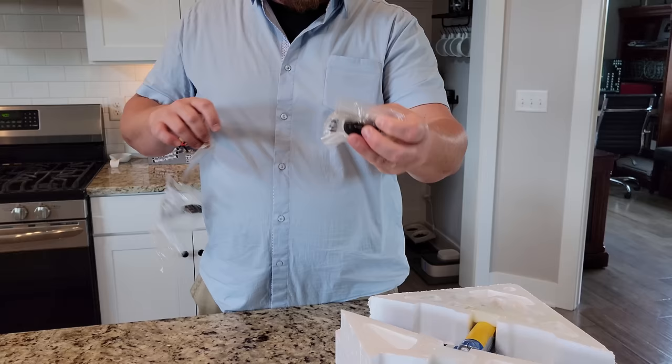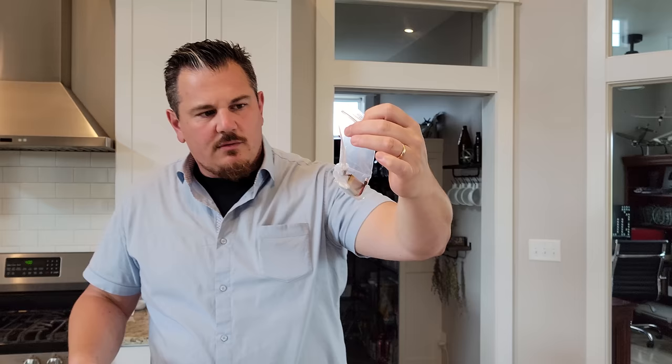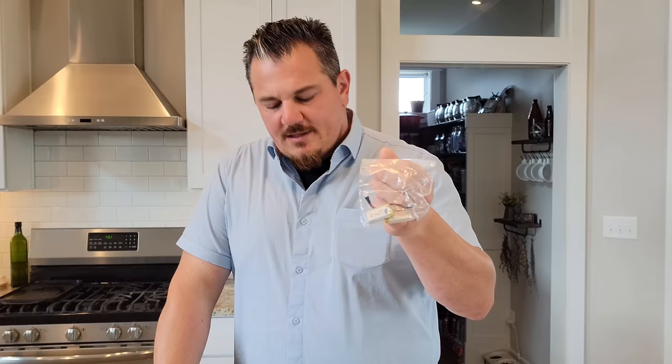And then we have a charger. Ooh, charger. We're gonna get into charging right away. And it looks like a couple of additional spare batteries that have not been secretly hidden in the fuse. What size do we have? These are 400 milliamps and they are 1S, so one cell in series. Yes, I know that seems a little bit intuitive. So one cell in series here, guys. We're gonna show you how to charge these things.